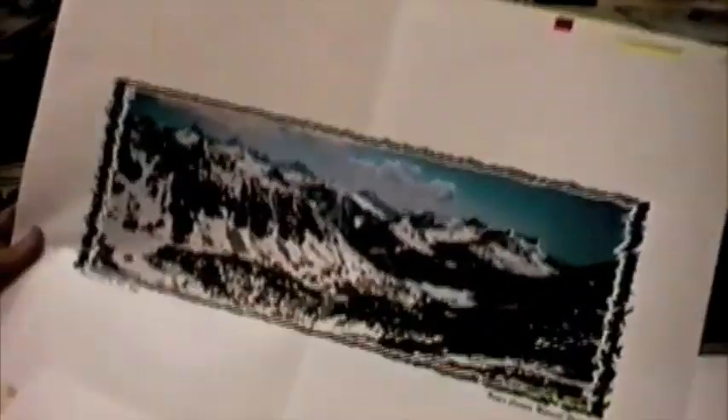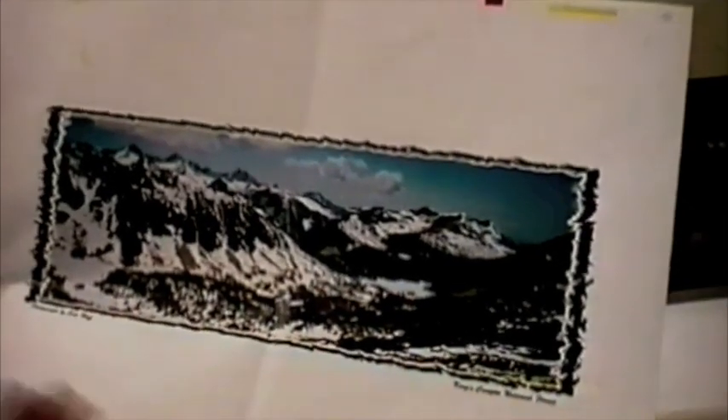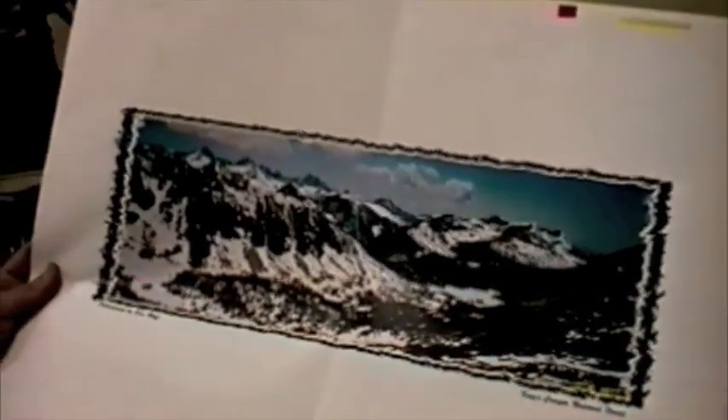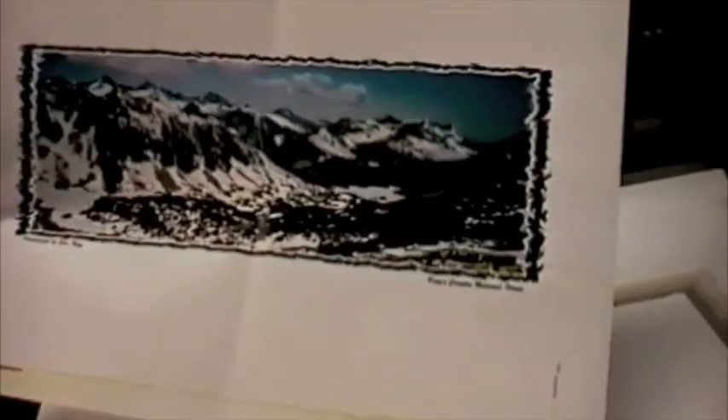The screen is quite coarse compared to a litho print — this is a 50-line halftone screen for this particular job. So this would be appropriate for printing posters and things like that, but not appropriate for printing something like a magazine. It would be appropriate for viewing at some distance away, not at arm's length — it's made like a poster or a display. That's one of the things we'll be talking about: the appropriateness of these various processes for given applications. With screen printing, if we're doing photographic reproductions, we can do that for effective viewing from a distance but not up close, and we'll be able to compare this to the other processes later on.